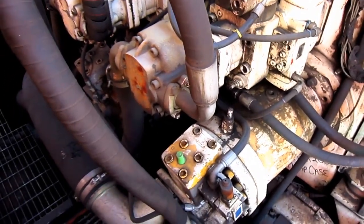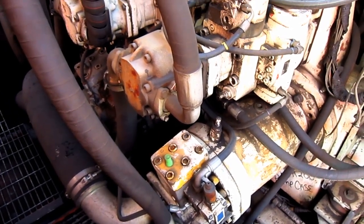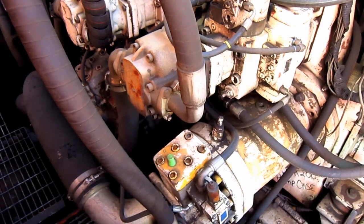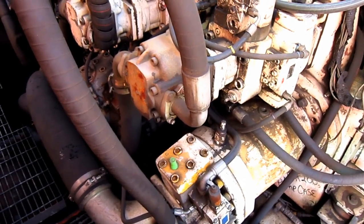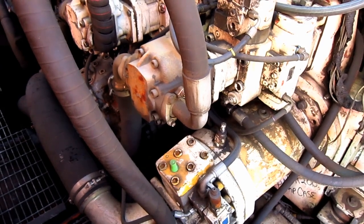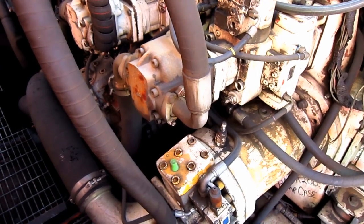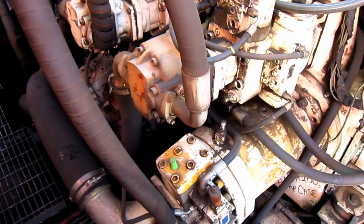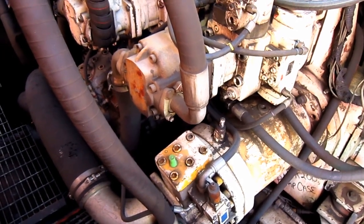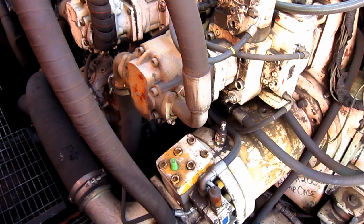Each engine on this machine drives 4 hydraulic pumps on each gearbox, which consists of 2 axial piston main pumps, each developing 244 GPM to power the front attachment and travel functions, and 2 swashplate swing pumps, each developing 93 GPM to power the swing system. The pumps cross-feed and the RH-200's pump managing system will pull additional oil flow from 2 or 4 pumps based on demand from joystick position and load. The pump managing system does this by continually measuring the actual values of the engine output and hydraulic system, and compares these values with stored target values, thus permitting improved pump precision.